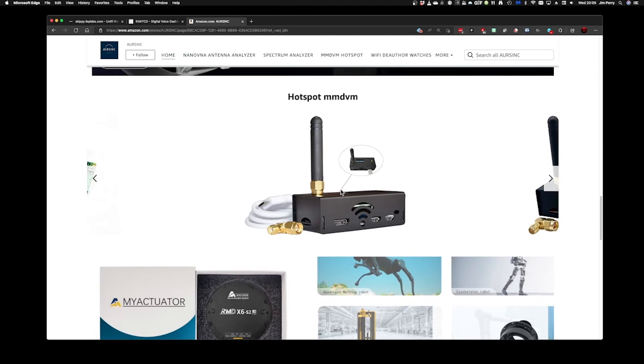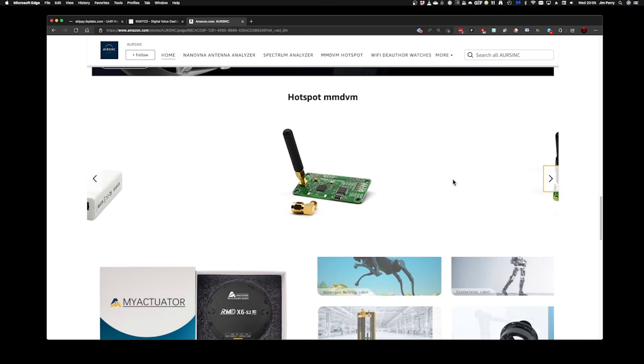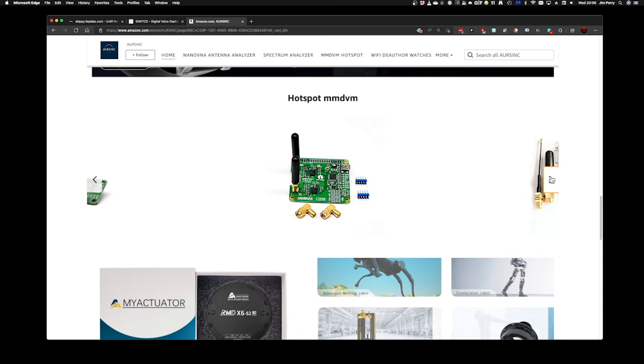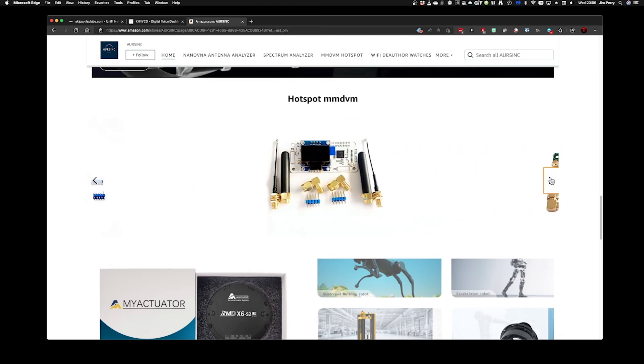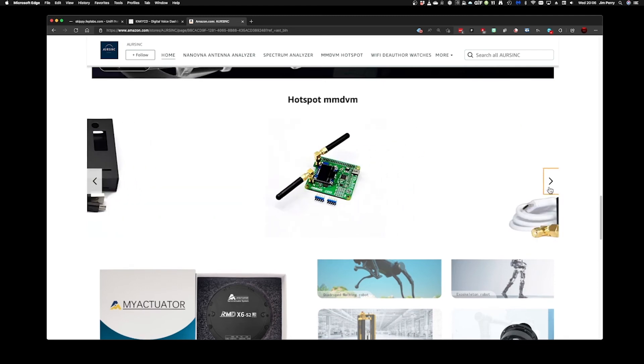Here's the hotspot — this is actually the one we have, because this is the version that comes with the USB Ethernet dongle. This is an MMDVM board which connects to your radio when attached to a Raspberry Pi running the Pi Star software. Here's a variation: this is a two-radio MMDVM board, which will let you treat your Pi Star hotspot like a repeater with an offset between transmit and receive frequencies. This particular one is a single VFO. Here are kits to put a lot of this stuff together, and you can see they have several variations available.